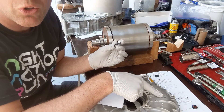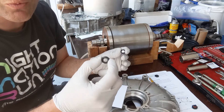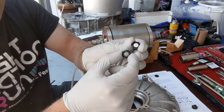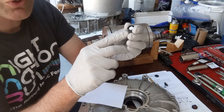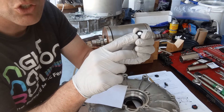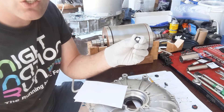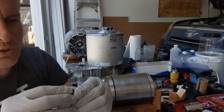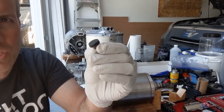I drilled a 5.5mm hole here to put a breather in. First I wanted to reuse the old breather from the inverter, but if you compare it to a new one, the old one is really dirty. Also, I touched the old one with my finger — this white material is EPTFE, it's extremely fragile if you touch it. I saw a measurement from someone else on YouTube where the permeability decreases by a factor of 10. You do not want that, so that's why I bought new breathers. You should just leave the protective cap on — don't take it off, don't touch it.